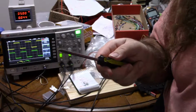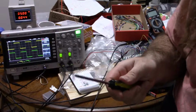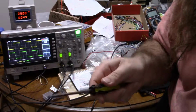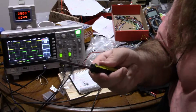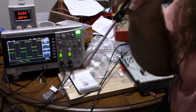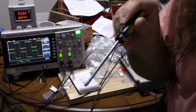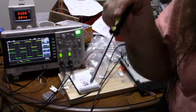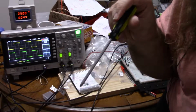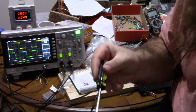If you add another resistor in parallel, that reduces the resistance. Remember the series and parallel formulas. So when you add a resistor in parallel, it reduces the resistance. But once you have the two together, if you increase one of the resistors' value without changing the number of resistors, you're actually increasing the resistance. If you turn it down, you're decreasing it.